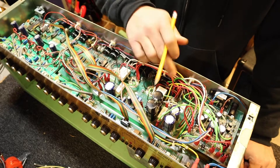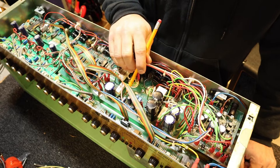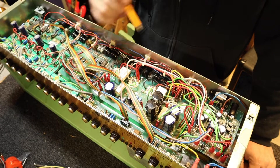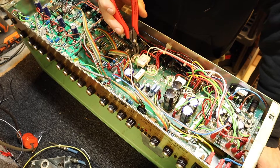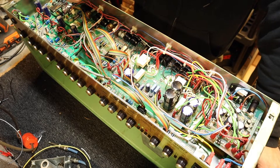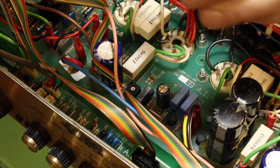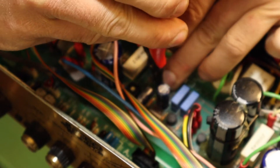Before I do anything, I'm going to leave the one side where it is — how they just kind of floated that — and recreate that on this side. I'm not going to pull the board, but I am going to solder a straight piece of wire over these two existing 5.6K resistors. Before I put the new tubes in, I've obviously got to replace that fuse. The two fuses on the tube section look okay, and all these other fuses test out okay. I've bent a piece of wire just like a staple, and I'm going to slide it right underneath these two resistors.